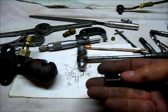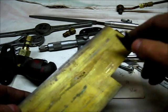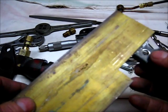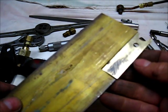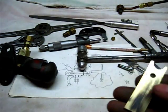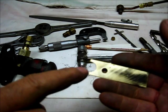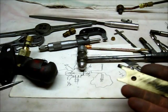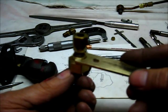This little item right here - that little hold-down thing - that's the next thing to make. You see this piece of brass right here? It's 1/8 inch thick. I like to work with that brass. I figured I could get one of them right out of there, and this is what I did. I sawed that piece free, just made a line down there and sawed it free. That left us with this little thing right here. I've already filed that, and it fits right up on there, really good.